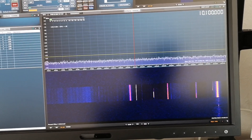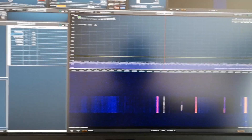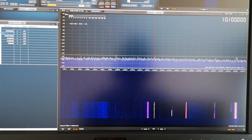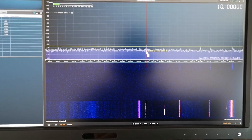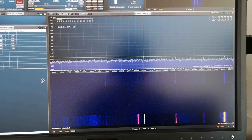On the long wire antenna you actually can't hear it either, so the long wire is not really producing much signal. I'm going to use it as the pickup antenna for my MFJ noise-cancelling device when that arrives in the post later today. The loop of course is not optimized for 10 megahertz - you can see a bit of signal but it's not tuned there. But this is where the mini whip really excels.